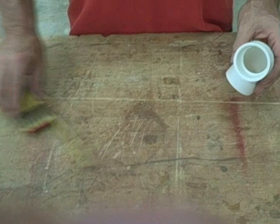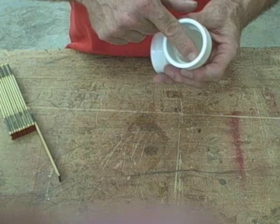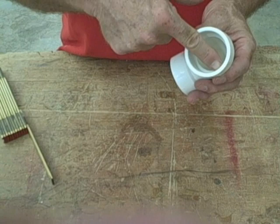Talking about our measurements — initially we just measured our pieces at six inches. Before our project we would have to measure each individual part, including the inside of this fitting right here. You'll notice that there's a taper. You measure to this long point right here, from there out, and get that measurement on each fitting or on each size fitting.